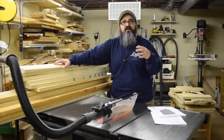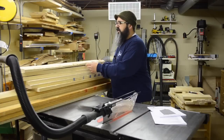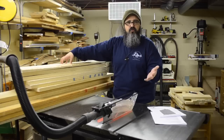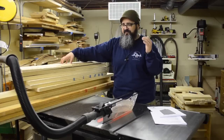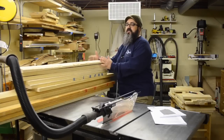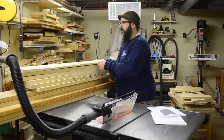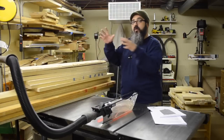What I mean is I want to look at the colors and grain of the wood — for example, for the top of the dresser or the drawers, I'm looking for woods that are very similar, if not the same, in color and grain pattern. So I'll go through the stack and keep matching boards together. Even in rough form, you can start to see the grains. Some boards may be too wild for a particular component, or too subdued where I want more pizzazz. That's one of the things I do while waiting for the lumber to acclimate.